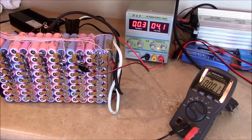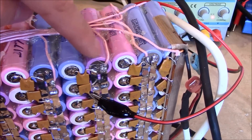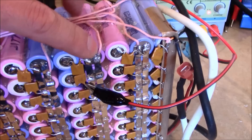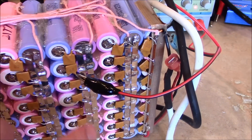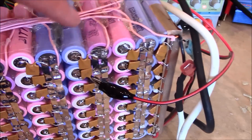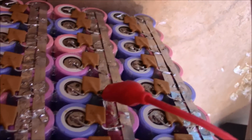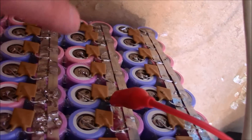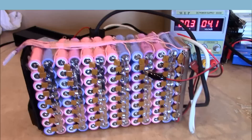I'll let that charge for a bit and come back to it. To give you a closer shot of how I'm hooking this up: the bank I'm charging is number 10, and the negative wire is connected here and pushing voltage through the whole bank — not just one cell, since these are all connected together in parallel. On the other side is the positive, and I've hooked it up right there on the positive of this whole bank. That's how it's charging.